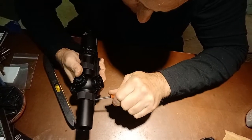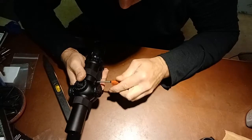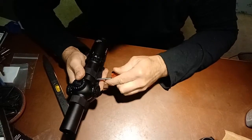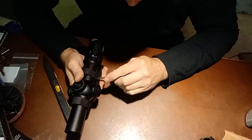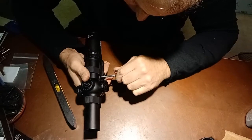They'll tell you the same thing if you're mounting a barrel into an AR upper. You have to do it like three times, put it in, back it off, put it in, back it off. So what I'm doing is I'm forcing the threads to break in. This way they don't loosen up over time, even though I got the Loctite on them. Back up. Okay.